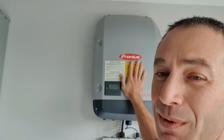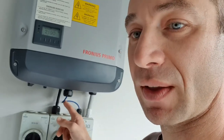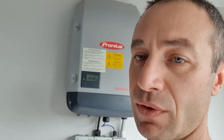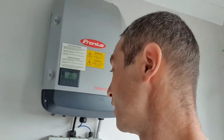This inverter has been here for two years, and besides the noise I don't think it's failing — it's much better quality. The disappointment was that when the installers first connected the inverter to the system, the software version it came with would not recognize the meter and the installer could not figure it out. In my books, if you charge that much money for a reputable brand, you should supply all the latest versions to installers and ensure compatibility with all devices of the same brand. The installer just gave up and quit, and I manually updated the software version and then it started working.